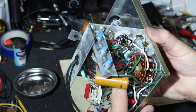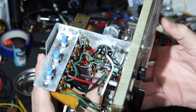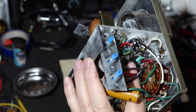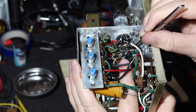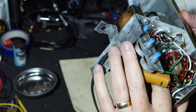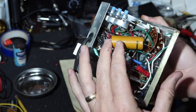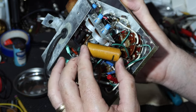I've got a capacitor right in there with the top bulging off it. You can see the black is popping out of that gray capacitor — so I'll have to check that out. Actually, we're going to replace it. It is a 10 microfarad 150. This wax capacitor I'm not sure about — I've got the schematic and I'll check it in just a minute, but that will obviously need to go.